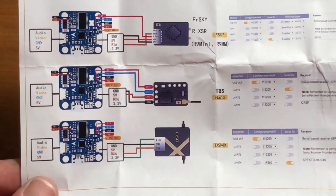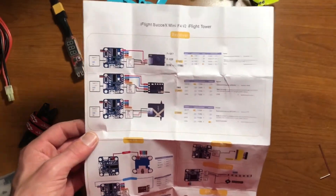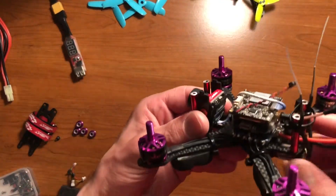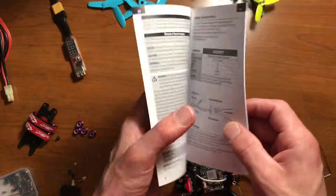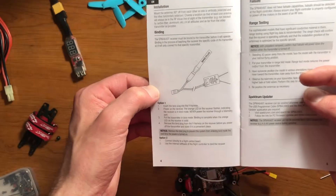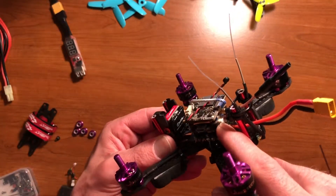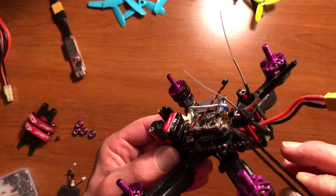This original diagram did not work for me. If I just needed power and ground, sure, but I needed the signal to connect. I don't know if this is an old manual, but I did just purchase this a week or two ago, so it shouldn't be old — but it didn't work for me. The binding process itself was fine: bind plug in the harness, power up, unplug the bind plug while still powered, then unplug it, then turn off your transmitter. But something with that pin was causing a short, because you need ground and signal to short out to put the receiver in bind mode, and it just kept doing that.